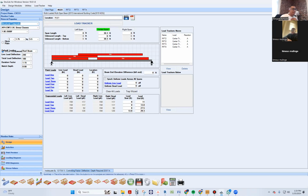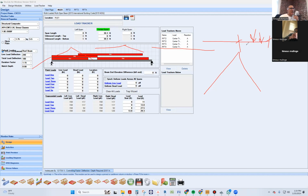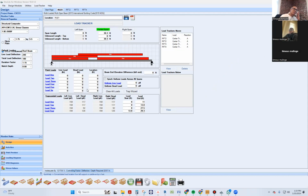By the way, for the purposes of structure, this and this and this and something less drastic than that are all the same. For the purpose of the structure, we treat it like load going perpendicularly down. It doesn't matter that it's going in a slope. I just thought the connection was, but that's okay. The only reason it would matter a little bit more is because the snow load may sit on one versus the other a little longer. But for the purposes of calculating structures, it's like going down straight on a distance.